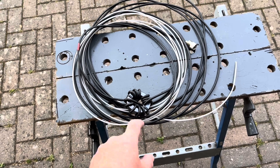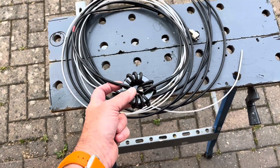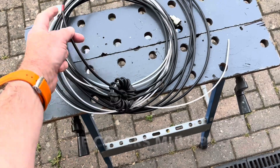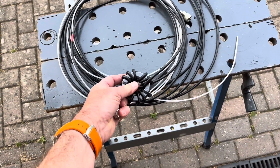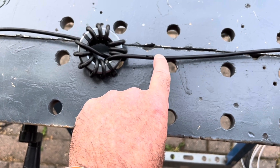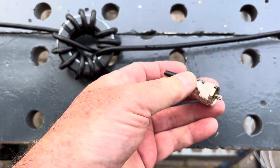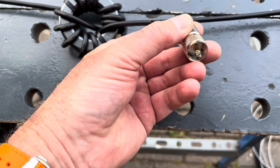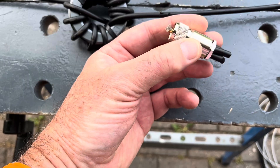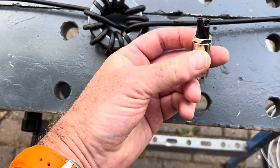The first thing I did was try to figure out how to make a full set of dipoles work together. This choke, as you'll know from the previous video, defines the bottom of the antenna. What I want to do is use this one choke to feed multiple tips — same base, same single coax plug, but multiple tips off this choke. Well, all of it didn't work. I've had to take a plan B. The original intention was to feed multiple tips from one plug, like a ground-mounted multiband vertical where the resonant tip takes all the RF. In this coax-fed dipole model that doesn't seem to work, so I've abandoned that and I'm now going to feed separate multi-tips that you can plug in as you wish.